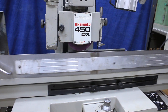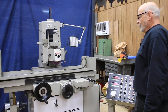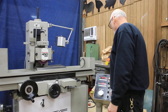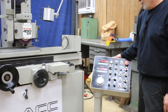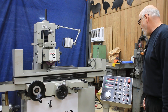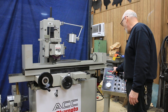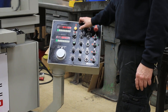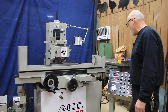We have two or three different cycles on this. There's a slot grinding or plunge grinding program so that we don't move the saddle. Here we're going to feed down a little bit each time as the machine is going back and forth. Once it reaches zero it comes to a stop, and then you need to set up a new part, go back into edit mode, and put a value in. Now we want to do a surface grind where we're going to bring our cross slide in — when the table starts, this column and slide will also be moving. Instead of the table reversing and the wheel coming down, it's going to wait for the saddle to reverse before the wheel comes down.